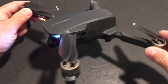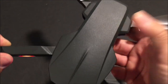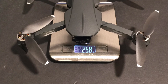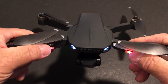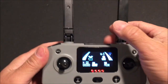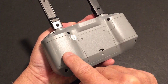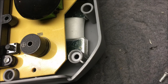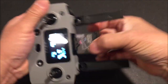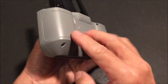The overall design of the quadcopter is really, really nice. The fit and finish looks really good, and the plastic material, although slightly on the thin side, still feels pretty solid. It weighs in at 258 grams with the battery, so it does weigh over the 250 gram threshold and will need to be registered. The remote controller has flip-out antennas, but they are just for looks — the real antenna is tucked inside under the circuit board. The gimbals feel really nice and smooth, and we have a two-position spring-loaded phone holder, but no fold-out hand grips.